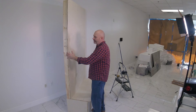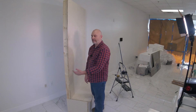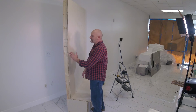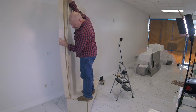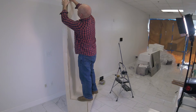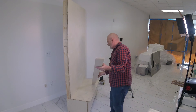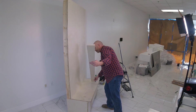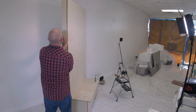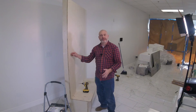The last part of the Born Handy phase is adding the side covers that conceal the 2x4 on the back of the chair. I've already ripped some plywood down to 3 and a half inches, and the 2x4 from the earlier step is spaced exactly the right distance so when the plywood goes on, we should have a flush edge and a square corner. Trim those to length at the miter saw. The easiest way to measure is to cut one end square at the bottom, put it in place, hold it, and place a mark where it contacts the plywood at the top — that way you'll never be wrong. Apply glue, set it in place, get a few screws in, and do the same on the other side. That completes the rough end of the high back chair.